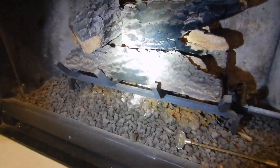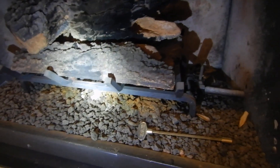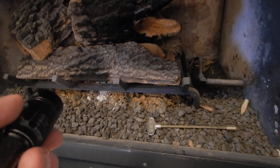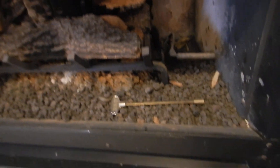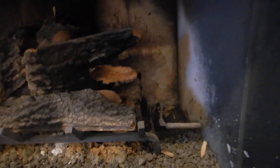This manufactured fireplace most likely was designed to co-exist, but it gets its oxygen to burn from the same place you get your oxygen — you're in competition with this fireplace. So while you're using it, you should crack a window or a door. That kind of ruins the romance, but you will live to love again. This house is not exactly airtight, but if you tighten it up, that's something to take into consideration, especially if you use the fireplace for a long time.